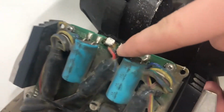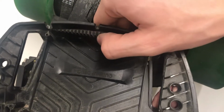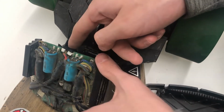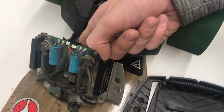Right where these solder joints come out and they bend down, you don't have a lot of clearance between here and the inside of here, inside your enclosure. So from right here to here, you have to make sure that these joints are not sticking out too far this way, and that they can bend down almost immediately and come straight down underneath.